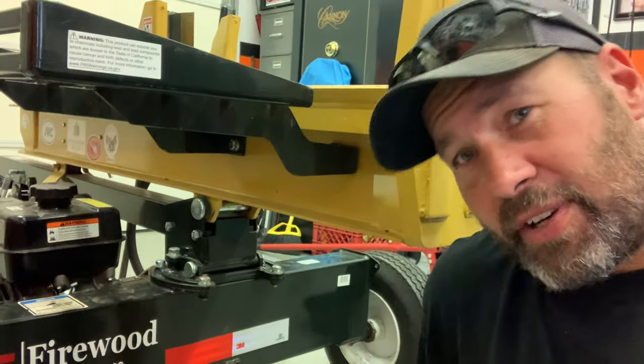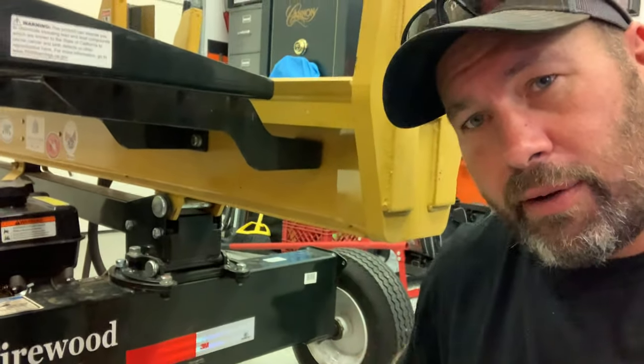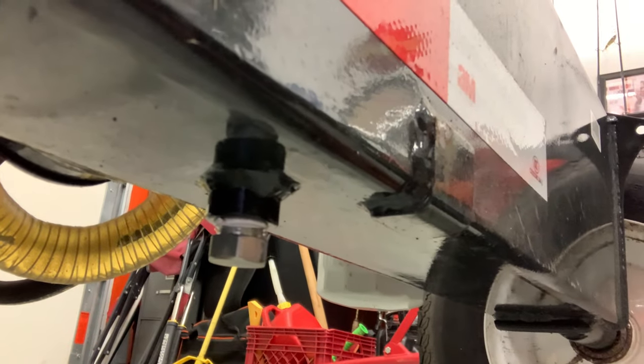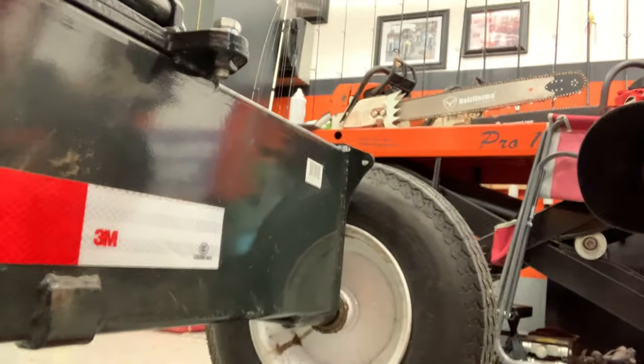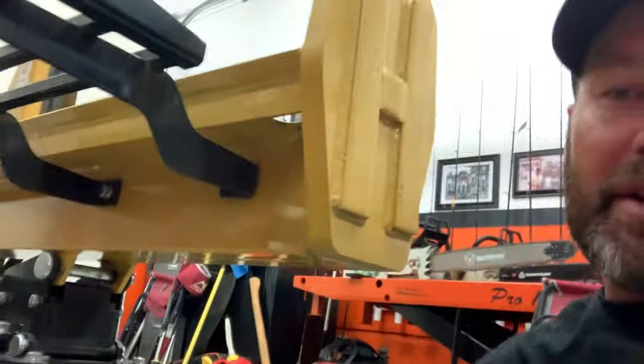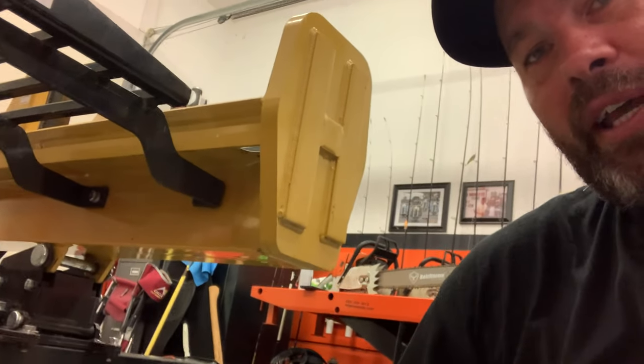You'll find your hydraulic tank plug on the very bottom near the center. It's a three-quarter inch wrench. The tank holds about four gallons of fluid, so make sure you've got plenty of drain pans ready. We'll pull that plug out and drain the fluid.